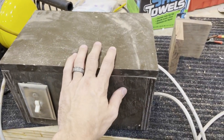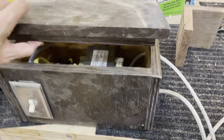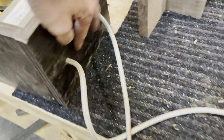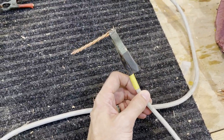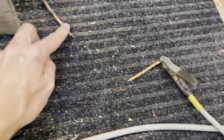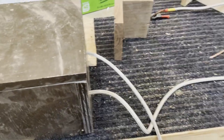What I'm going to be using to do this — I built a box. You can do this with a transformer out of a neon sign, which does finer lines. Or we've taken a transformer out of a microwave and wired it in using some thick cable. It's not plugged in — this is dangerous so you don't want to be messing with this. I put clamps on the end and made a couple of copper end pieces that allow for better conductivity into the wood. I will have the lid on this so I don't accidentally touch anything, and I'll put a hard surface like a piece of stone down before I do this so it doesn't conduct through wood or carpet.